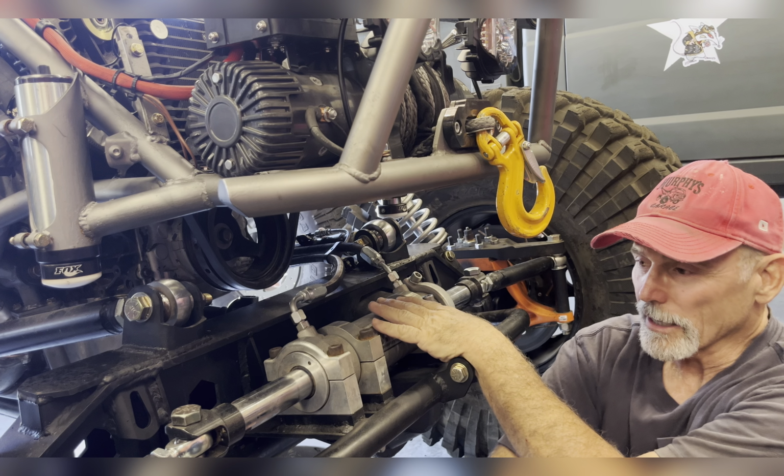This particular buggy, they already had built them out and they had installed the double-ended ram. Now I'm doing the plumbing, I'm doing all the linkage. And the trick on this one is I'm not just doing this on the front end, I'm doing it on the back too. This is a front and rear steer vehicle. So a couple things real quick on full hydraulic steering. One, which I know a lot of people have a huge concern when they get ready to go from a mechanical steering box with a hydraulic assist, for instance, to a full hydraulic steering on these buggy type applications.